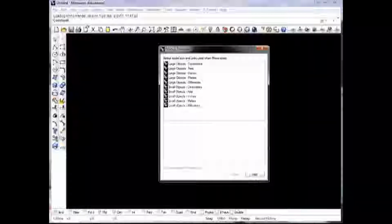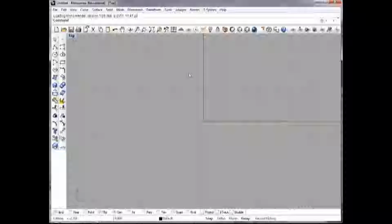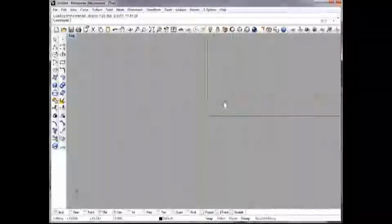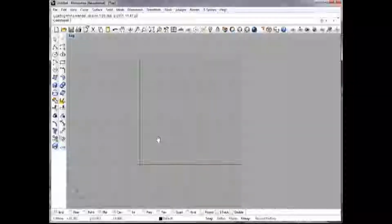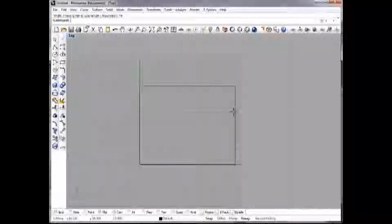Okay, I've started my CAD program, Rhinoceros, that I prefer to use, comfortable with. I'm going to select a project of millimeters, since a lot of my measurements were taken in millimeters off of the airplane, and servos or servo holes and things like that, so kind of arbitrary. But anyway, I'll start by making just my simple rectangle here, and we said it's going to be 94 by 74 millimeters.